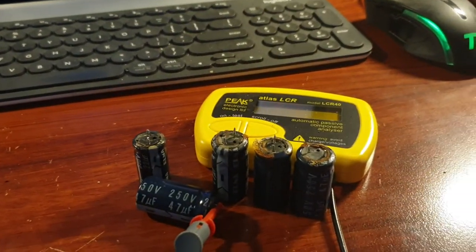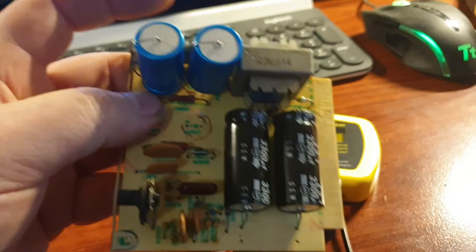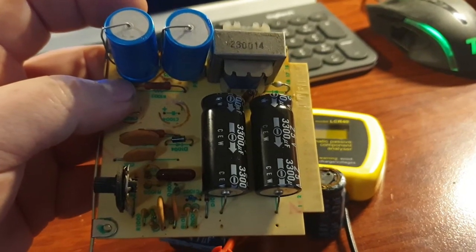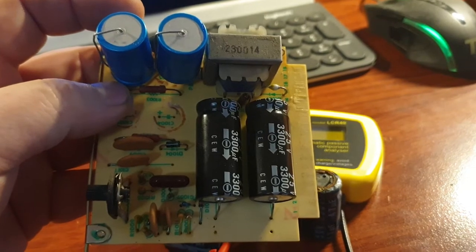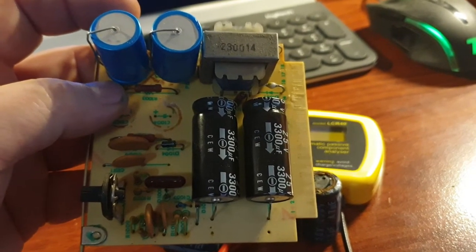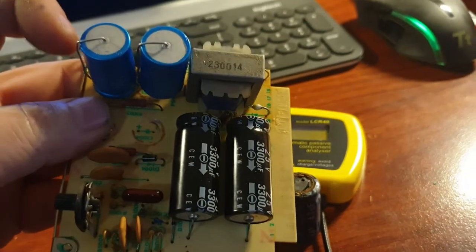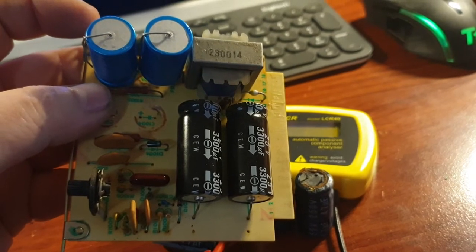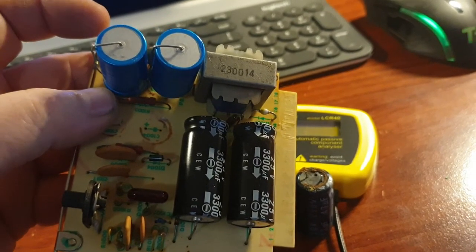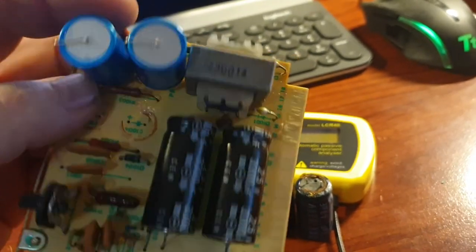When you're on a 901, those two rear cards — pull them out, have a look. Don't do what we're doing here; it's only that I know we can do a test just to prove something. Generally there are some pretty wild voltages coming off some of these leads, so you don't want to have them exposed. When you're putting your fingers into the 901, be very, very careful, of course.